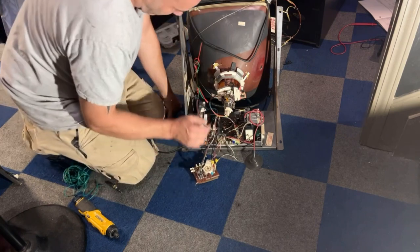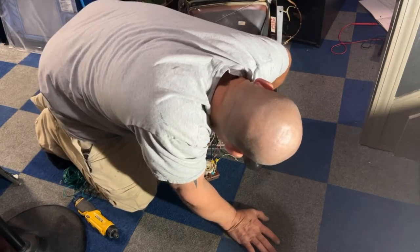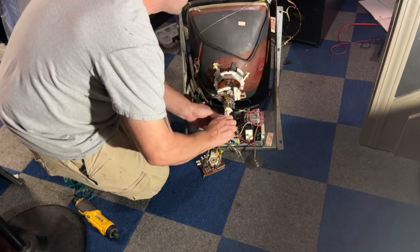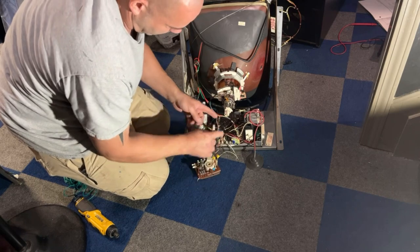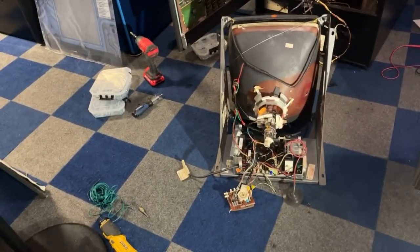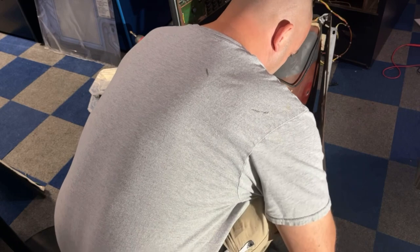So we got the neck board to hook up and we have this wire here. You know what? Maybe I'll just cap it together. Just got a little bit of a shock there. Usually I'll discharge that tube. It got me a tiny bit, but it didn't hurt. Some people will use an electrical cap that screws on. So let me go see how I want to cap this. I was going to put some connectors on there, but I think twisting them is probably just going to be fine. We're just going to put a crimp cap on it. Cut it down, it's a little too long.